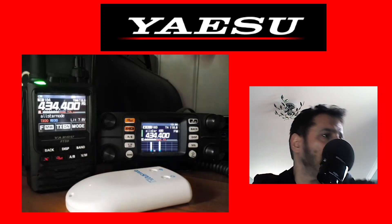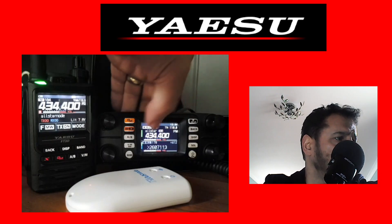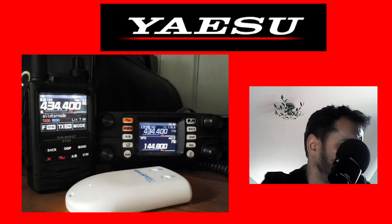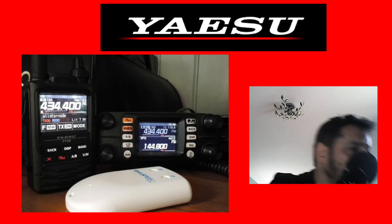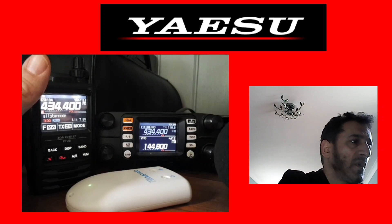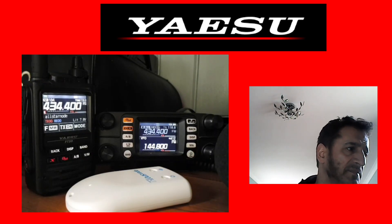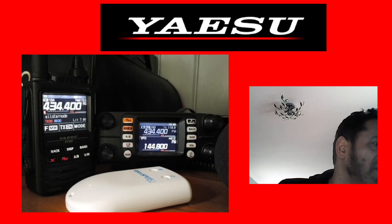Let's see if I can get it into APRS mode. We're going to go to VM on the B band, go A/B, go to VM and get it onto the APRS frequency. When APRS is turned on you have a little circle indicator — yeah, it's already lit next to A12, so there's APRS. That's coming in on my collinear antenna in the loft.